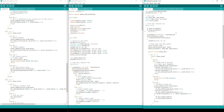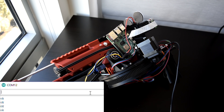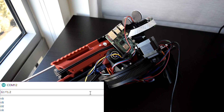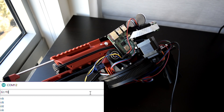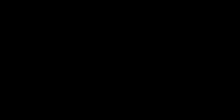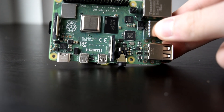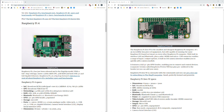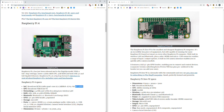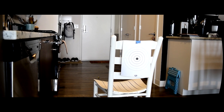I added a new feature I'm dubbing the Velocity Engine, which is just a fancy way of saying you can update the motor set point at any time, even if it's still moving, and it adjusts its motion profile to accommodate. I spent like eight hours coding this. Other improvements include the Raspberry Pi 4 — more power, more better. The new firmware and Pi are important because I want to do fast tracking so the Nerf gun can keep up with aiming at things in real time.